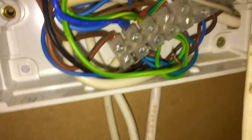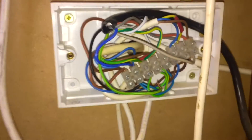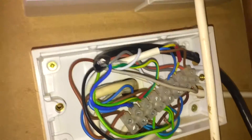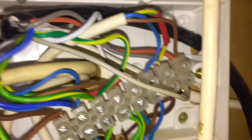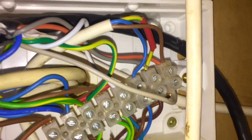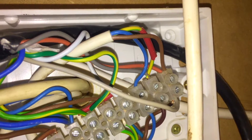Under this cover here I've taken it off, I can see there's an earth wire hanging out there already - I've got to check what that's for, but obviously that should go somewhere. I've done a little bit of testing on the cylinder stat wires. I traced the cylinder stat cable by just grabbing it and moving it in the box. It's a brown, a blue, and an earth with some red tape on it. I put one probe on neutral and checked all three of them. Only one of them had power, which was the earth with the red tape, which is also connected to the grey of the 3-port. That wire in with the grey of the 3-port should be hot water off. The fact that I've got 240 on it tells me that nothing is telling that 3-port to be in hot water mode.